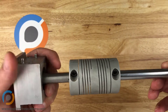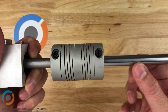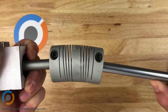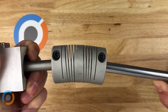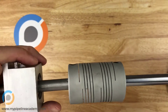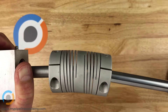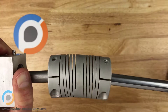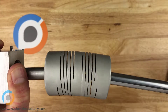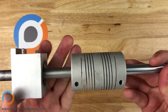I'm going to exaggerate here what a flexible shaft coupler will do. Remember we're pretending this is a motor shaft. What if that was offset by several degrees? This is probably three or four degrees offset, something like that. In reality you'd never run it if it was that far off — if it was that far off, something's wrong in your design or the manufacturing was off. But just to illustrate the point, you can see how I can actually move this, and it's not terribly difficult with several degrees of misalignment. That's what a flexible shaft coupler will do for you — it gives you the ability to couple shafts that are not perfectly aligned.